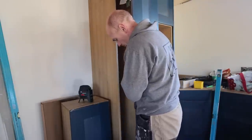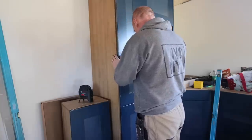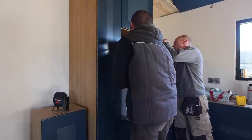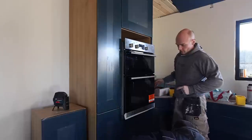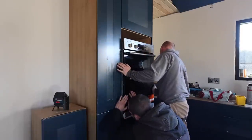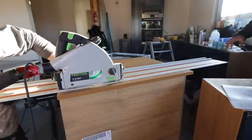To the left of this pantry or larder unit is where that fridge freezer will go. And I'll be putting some heavy duty anchors into the wall here to fix these units. Because remember, when you start pulling out a fully laden larder unit like that, there's quite a lot of weight pulling on the wall. So I've intentionally fit some studs and noggins in the places where I know I'll need them. Next job was to cut down a couple of the units.